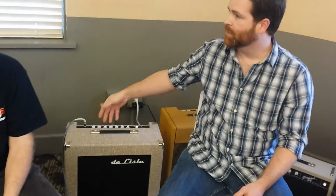Yeah. When I first started, I bought a bunch of 5-watt amps. I bought the Vox AC4, Gibson GA5, and a lot of the current production stuff. And I just kind of worked my way through each of the models, and designed the things that I didn't like out of my own design. So the first one that I came up with is called the Nickel Box. It's just a 5-watt single-ended amp, but it's in a cabinet this size. It's got a 12-inch speaker. It's got, you know, bass, treble, tone stack, and a host of other options that you can get.